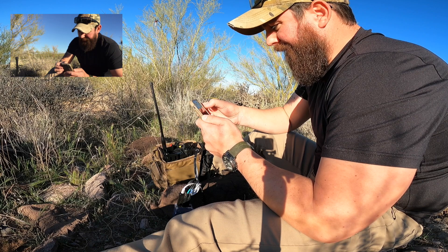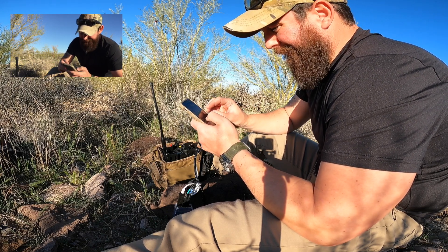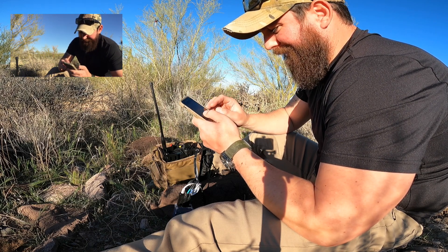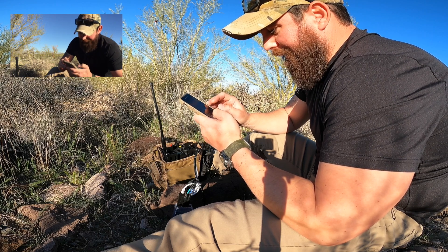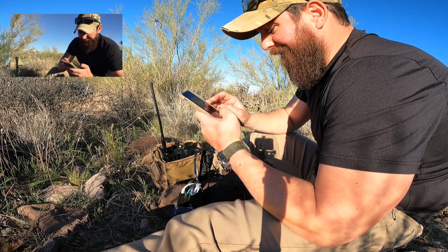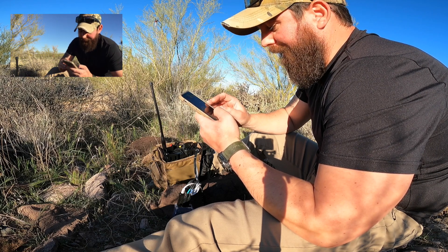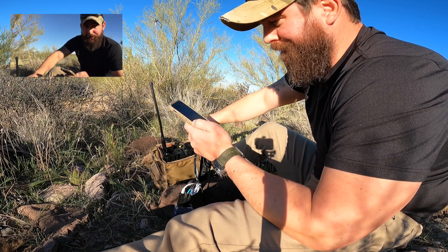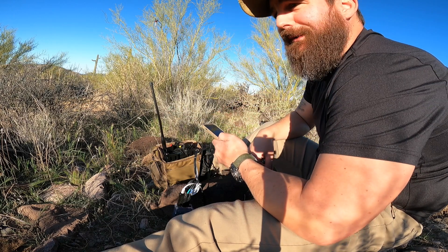There we go. Now we're going to go to the menu, go to Action, Connect, and I'm going to show the RMS list. We're on a 40 meter dipole and I'm going to try my luck at a station I'd like in California — Whiskey 8 Bravo India, 615 kilometers. Click Connect, we'll turn on the volume. And we're transmitting right now.